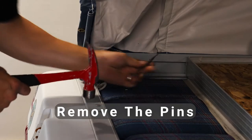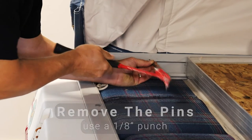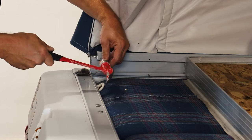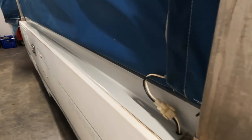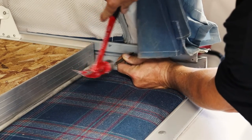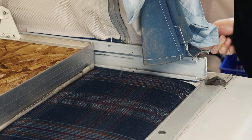Now it's time to remove the roll pins. Using an eighth-inch punch, clear the pins from the body rail. You can drive them all the way out or just drive them out of the channel. On this side I've cleared all three just past the channel. Repeat this for the opposite side as well. The top ones I drive from the inside, the lower ones from the outside.